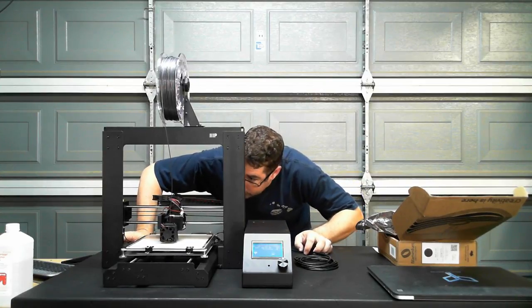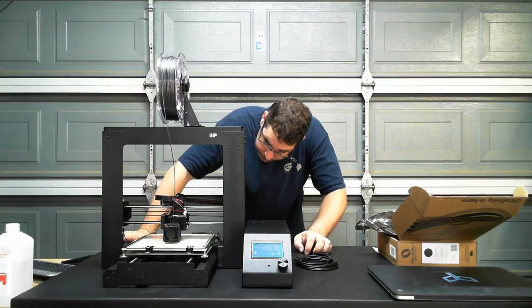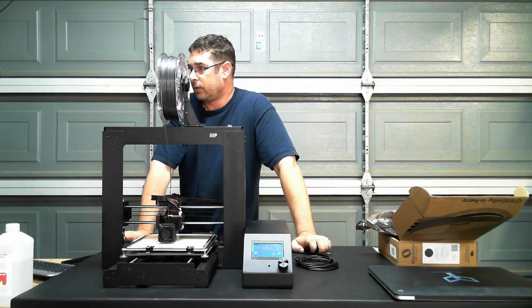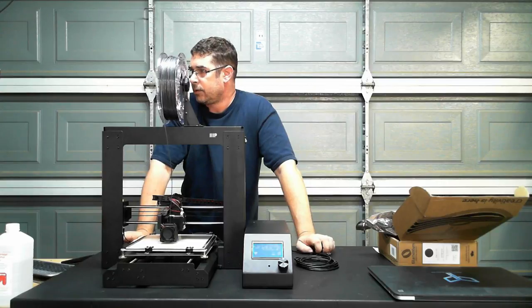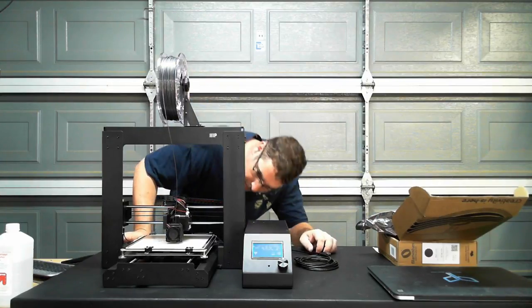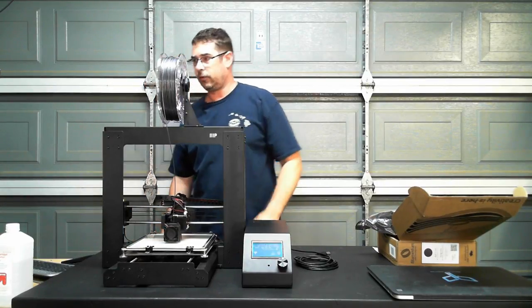We'll see if it corrects enough on the next layer. I may have actually sliced this at a 0.06, which is explaining why our first layers are so, so thin. All right, so while this tries to get some layers built up, it doesn't look like there's much on there yet, but